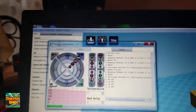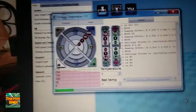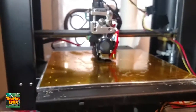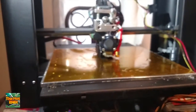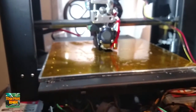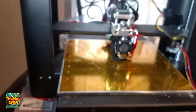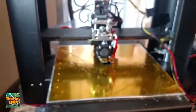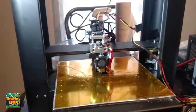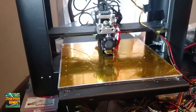The other important command is G32. G32 is the command that does auto-leveling on the Smoothie, and I'm going to send a video of that shortly. But I wanted to show you guys that it is worth it, because we're printing our first test cube at 20 millimeters. Hopefully it actually comes out at 20 millimeters, but who cares at this point.